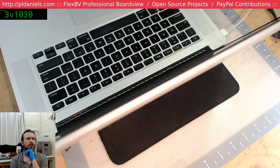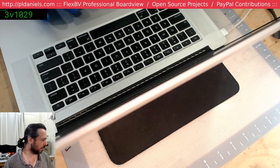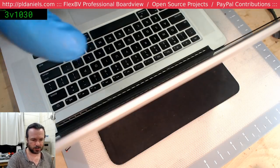Fault on the logic board causing it to reboot after about 2 to 5 minutes of operation. Oh, okay. Started after there was a bad power brick with a frayed cable causing a short, and ever since then it just randomly reboots. Under Windows or Linux, the computer runs okay. That's going to make it fun. Problem persists even with a new Mac OS install. Oh, crikey. Yuck. Alright. So basically it's an intermittent fault that seems to happen within the Mac OS itself after it got some sort of short circuit on the DC input.